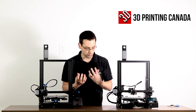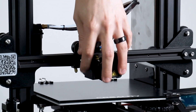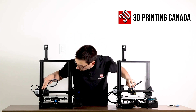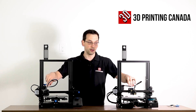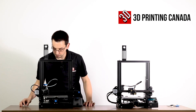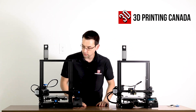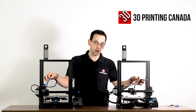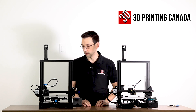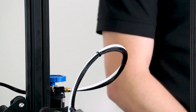Back to the front, both have the same bed leveling wheels — neither comes stock with auto bed leveling, so you need to adjust that manually. They both share a somewhat similar hotend, though the V2 has a different, more covered plastic design instead of metal. They're using the same carriage — generally the same three-wheel X carriage as before — and both use the MK8 or variants thereof for nozzle tips. They're both PTFE-lined hotends, not all-metal, so keep that in mind when attempting to print higher-temperature materials in the range of 245-250°C and up, as the PTFE tube life will be diminished at those higher temperatures.